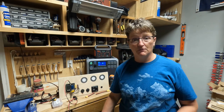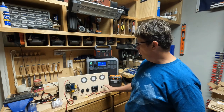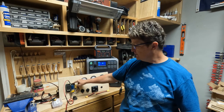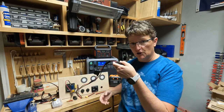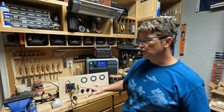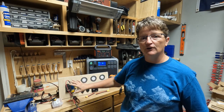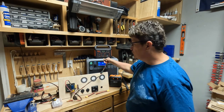The cable that you have just made is protected, so all your lights and USB ports go to one location. Your fuse panel has a positive and a negative — that's where your black and red wire from your cable gets plugged into. That gives you power. Unplug your cable and you lose power to your entire van. So if you have to work on something, all you've got to do is unplug the one cable. You've lost power to your DC panel, you can work on whatever you need to, and then plug your cable back in.